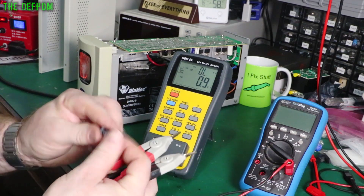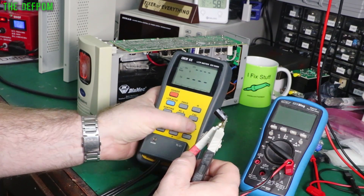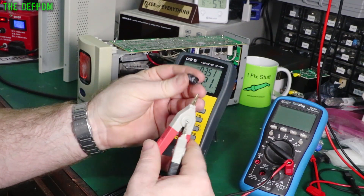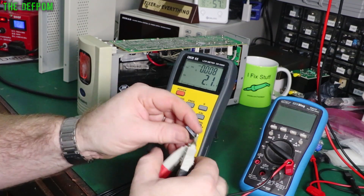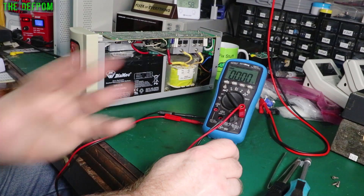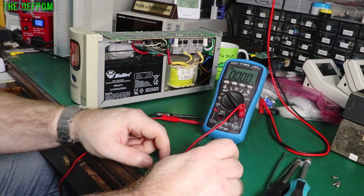For the sake of completeness let's get the LCR meter set up and see what we actually get out of this cap - a meaningful measurement. It currently thinks it's an inductor, so that's probably not a good thing. As soon as I switch to capacitance - yeah, it's definitely completely open, it's not doing anything. That's definitely a dead cap. Make sure you subscribe, click like, and give us a thumbs up and comments down below. Thanks for watching.